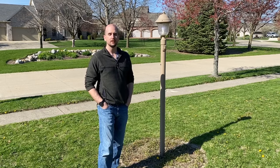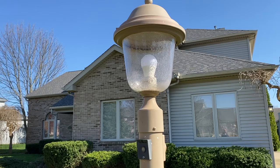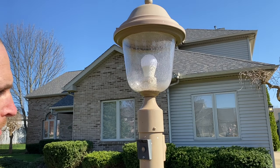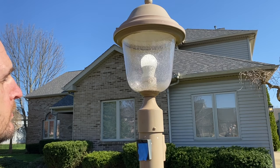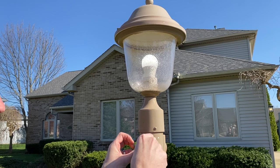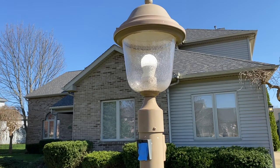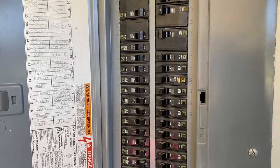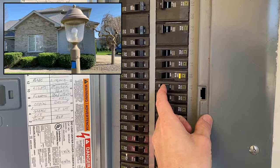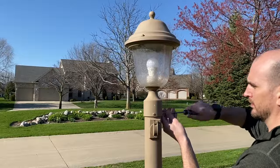It's a pretty quick little weekend project, and I'll show you the few steps involved to get this done. First up, assuming the power is on to your light post, you'll want to apply some tape over the photo relay - this will give you the appearance of nighttime so the light will actually receive power. Find your circuit breaker and flip the switch, confirming that the light goes out with the tape on. Now you're ready to start.